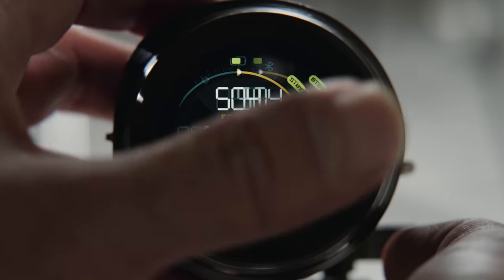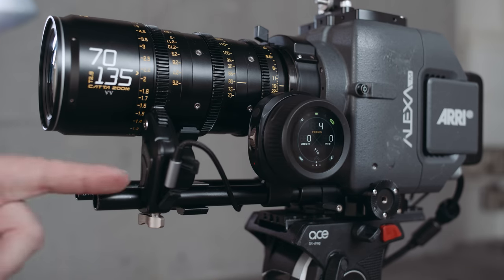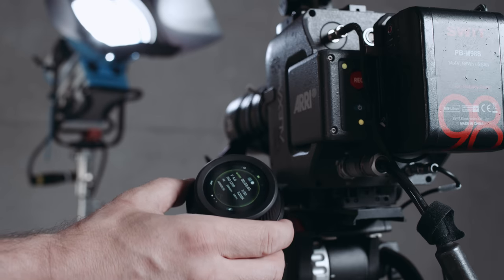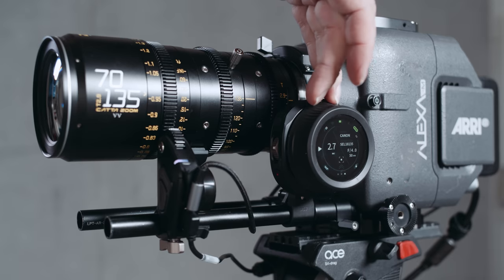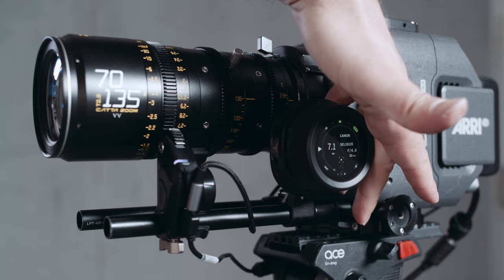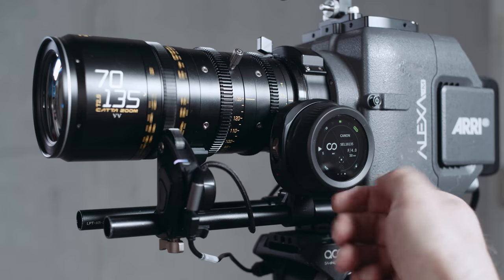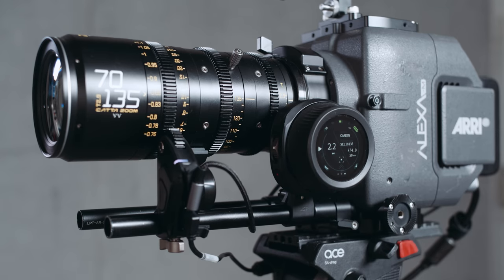Basic functionality was stable and ready for action. We tested torque and speed using USB-C at charging currents and via direct connection to USB outlets of V-lock batteries — pretty much how you would use it on a shoot — and the motor didn't show a significant difference in performance between setups. The Nano 2 is not a powerhouse, and in this power/price range it's not expected to be. If you pull focus very quickly, the lens is very stiff, or it has a very long focus throw, focus will lag behind. I don't think this is a massive problem as you usually don't pull focus that hard. Even crash zooms should be possible as the zoom throw is much shorter.